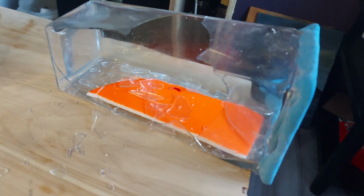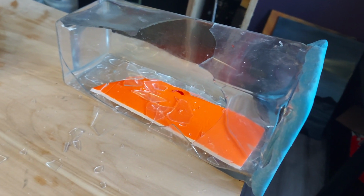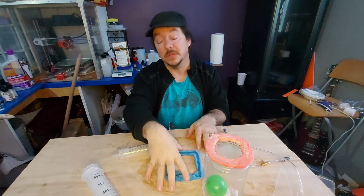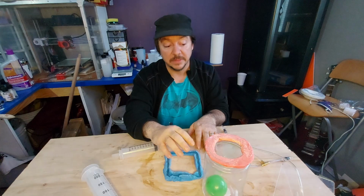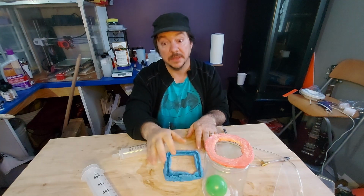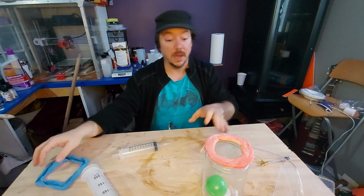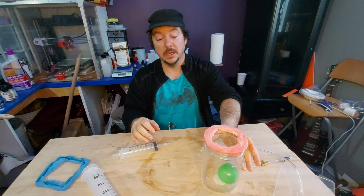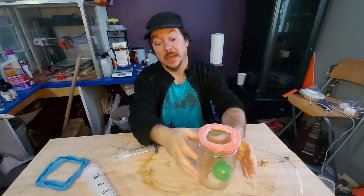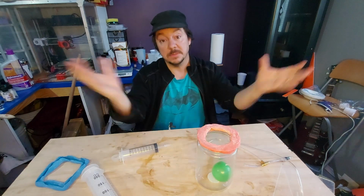So as I was creating a vacuum on it, the whole thing imploded on itself, sending glass in a couple of ways. When I'm doing some of these, I'm going to start wearing a little bit more safety gear, because that scared the poop out of me. Things blowing up with your face near them is not an ideal thing. Always consider safety. So we're going to be going forward with that. This glass is extremely thick, so it shouldn't break. The benefit of a vacuum chamber is if it does break, it will pull everything into itself. So it's not like an explosion.